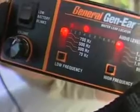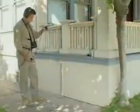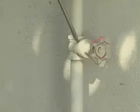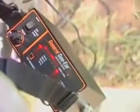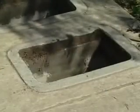If you hear the sound of a leak, check lines running in all directions from that point. The leak location is usually found between the loudest and second loudest survey locations. Now, you can begin to narrow your search and isolate the leak. To accurately pinpoint the leak, you must have an accurate location of the pipeline.